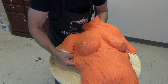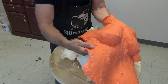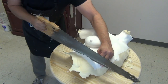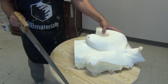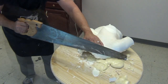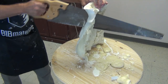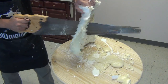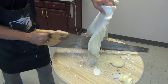This is a self-releasing silicone formula, so it doesn't have as high a tear strength as some other formulas, but it does self-release beautifully. We're just carefully removing that from our positive. Now we can do a lot of our cleanup work to get that stylized form just using woodworking tools. A handsaw like this works great for trimming up parts like this, and a wood rasp works great as well. One detail I didn't bring up at the beginning is I actually cast this part bigger than I needed so that I could cut it off and get nice straight edges on what will ultimately become an anatomical model.